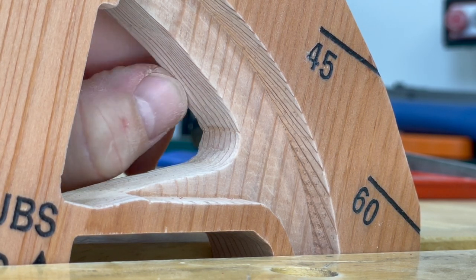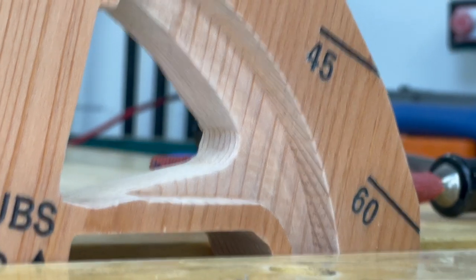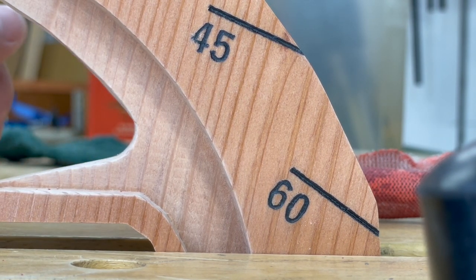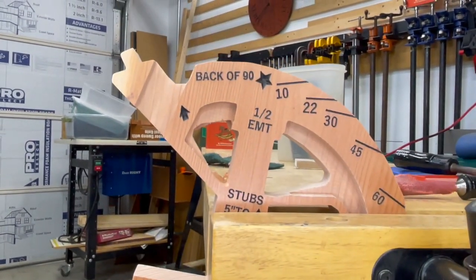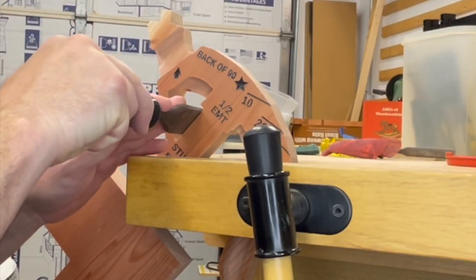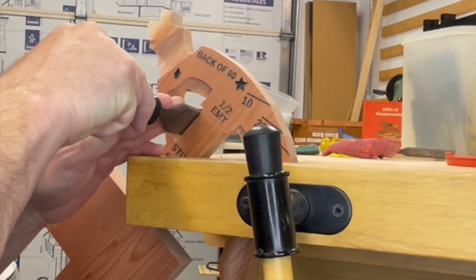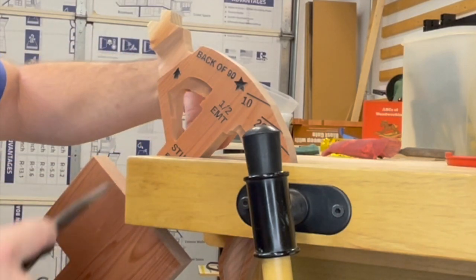Now we have a pretty smooth surface. There's still a small lip here — it looks exaggerated because of the camera angle, but if you shift around you can just barely see it. For the amount of work required to fix that, and the fact that nobody is going to get closer than about 18 inches away, I'd say that side is good. Using the larger chisel gives you a far flatter surface — for a two inch gap the one and a half inch chisel works really well.